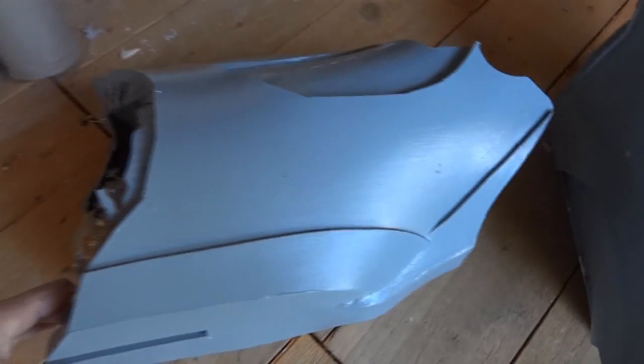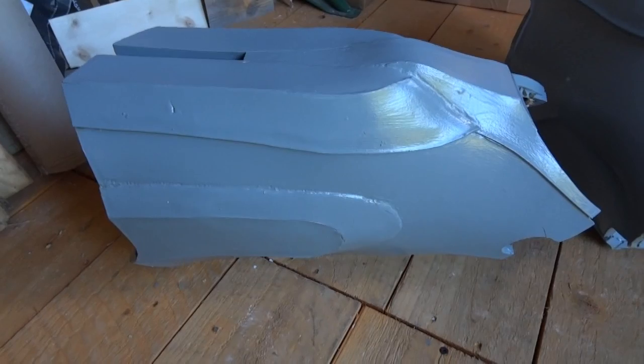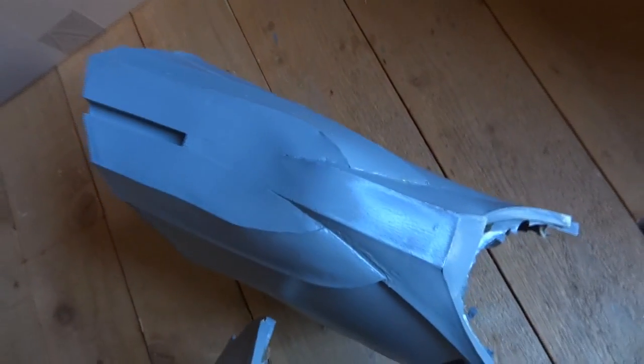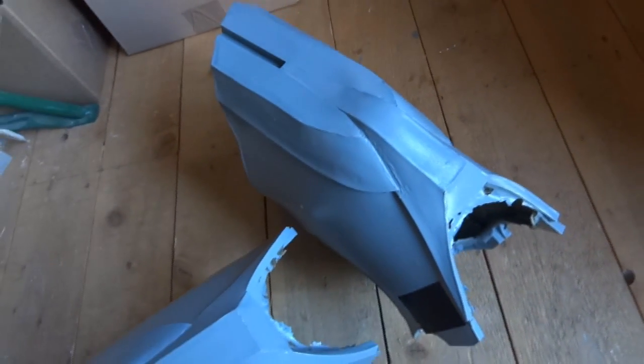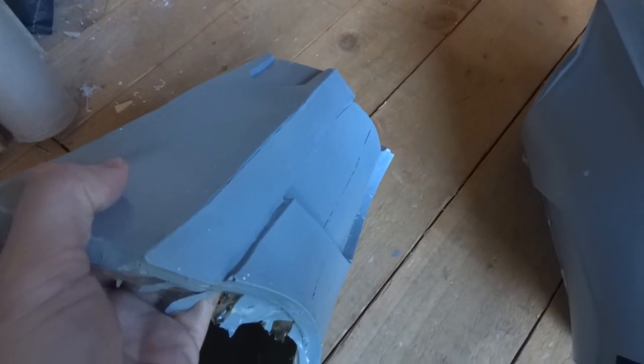The other issue is that they're not really very good, because the original moulds were made from the original pieces which were made of foam. You can see that quite a lot of the lines are quite bendy — that's because the foam warped during the moulding process, so there are all sorts of lumps and bumps. They need a lot of sanding down and cleaning up, and some of it's just absolutely terrible — it looks like foam but in fibreglass. Cutting them in half and sorting that out is also a problem because the two halves probably won't line up again.